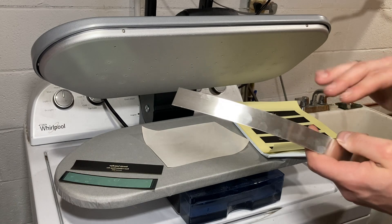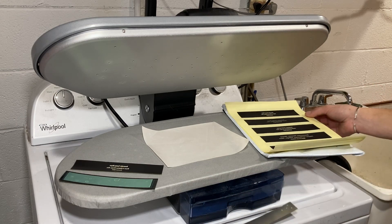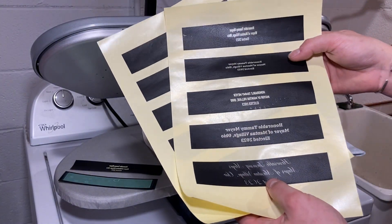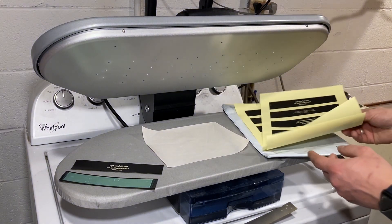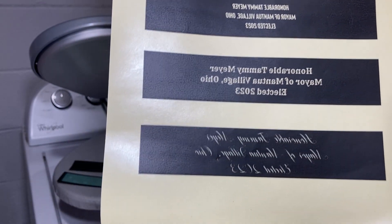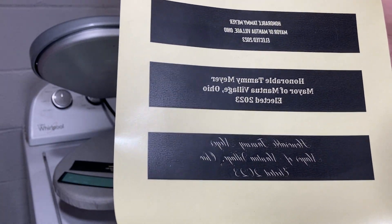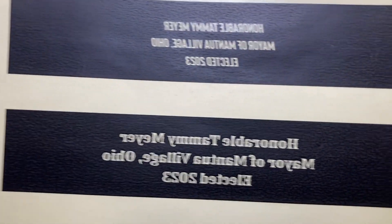In order to do that you need to mask everything that you don't want dissolved. The process we're using today involves a laser jet printer and transferring to glossy transfer paper — there's a link, it's relatively inexpensive, about ten dollars for 20 sheets. You take your design — mine is only text, yours can be whatever you want to etch — and it needs to be printed in white. Whatever is white the acid will attack; whatever is black will be masked. So you invert the colors. I used simple Microsoft Word: black background, white font, then invert the printing in your print settings.